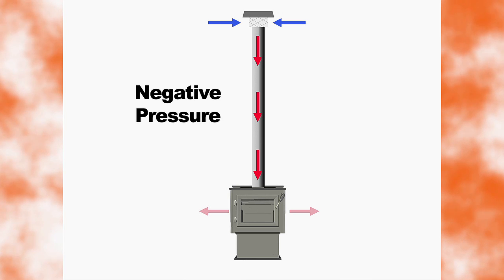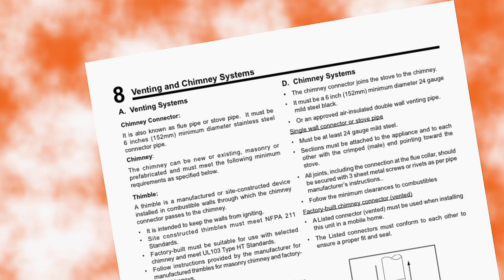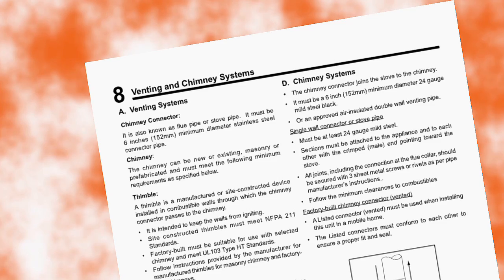It's also important to remember that other appliances in your home may have a mechanical operation that competes with your unit for available air supply. This can lead to a negative pressure which can affect the operation of your unit and should be avoided. Letting exhaust gases or odors into the home is dangerous. These issues can be addressed by following the guidelines in the venting section in your owner's manual.